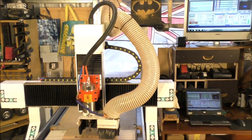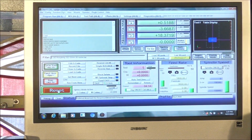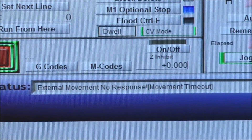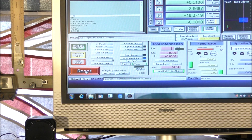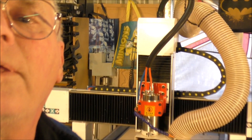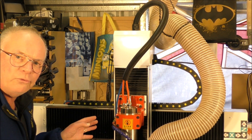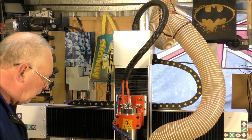What the hell has that got to do with the water pump? I'll just show you. I'm going to take you here to Mach 3 and zoom in a bit. It puts it into emergency mode. That just shouldn't happen, because the card inside the machine gets its power from the computer, and the computer is seeing it. The only thing I can put it down to is that there's a fault in the pump that's leaking power through the water and through into this, and it's getting some sort of back feed.